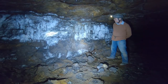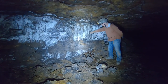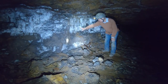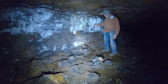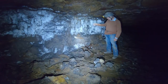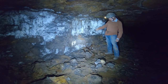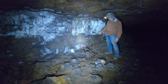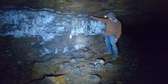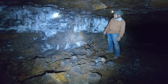This is the ironstone main seam and it consists of two blocks. You've got an upper block of ironstone, and down here a lower block. Between the two, marked by this dark band, you've got a band of shale. Now to work the ironstone you've got to take out the full amount, but the shale is detrimental to the ironstone when it goes to the blast furnaces, so that's got to be dumped. It's the ironstone at the top and bottom that's the payload — that's what pays the money.